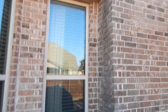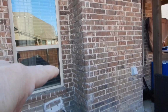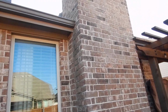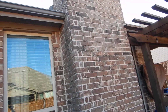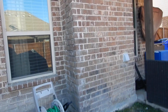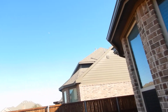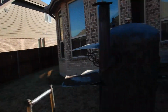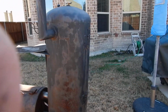So we've got the same problem over here with our fireplace. See those stains right there? You know what made those stains? Water made those stains. Water's been in the brick. See how close the rain gutter is to that? Water's been in there a long time. Water's going to be in there a lot more. The more water that's in there, the more wood that's going to rot around there. That's a potential problem, a latent problem. Is there a problem behind there right now? Maybe not.